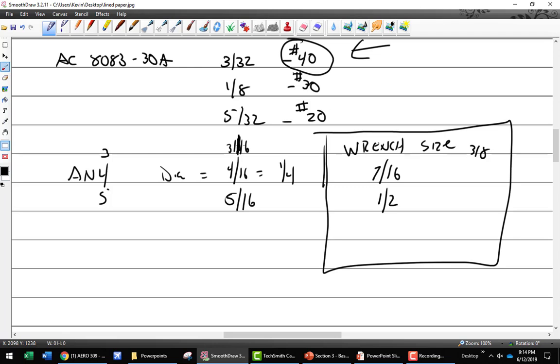Now what if I want it to be a fraction? Do it again. Hit the second button, hit the fraction to decimal, and boom, there it is, back to 7/16. Okay, compound for like 1 1/4. Then we'll clear it. You just do it again. So it's 1 ABC, 1 ABC, 4. So that's 1 1/4. Then decimal would be 1.25. Let's prove it. Second, fraction to decimal, 1.25.